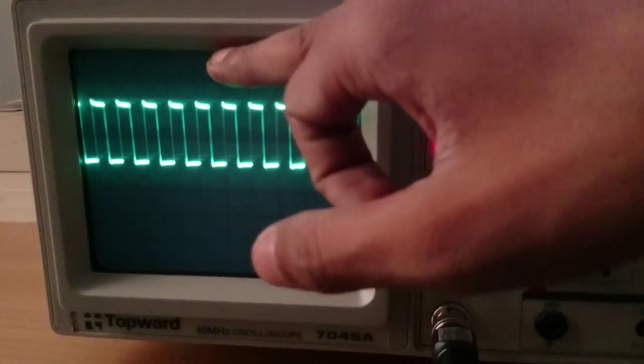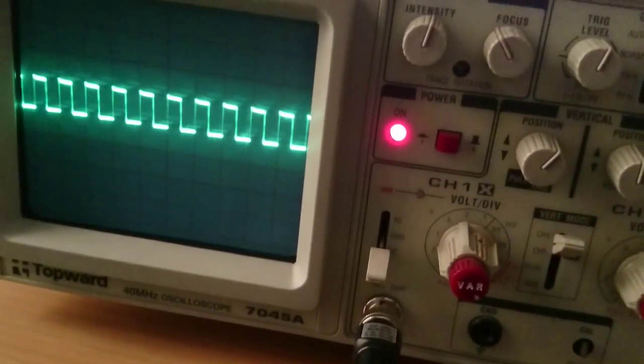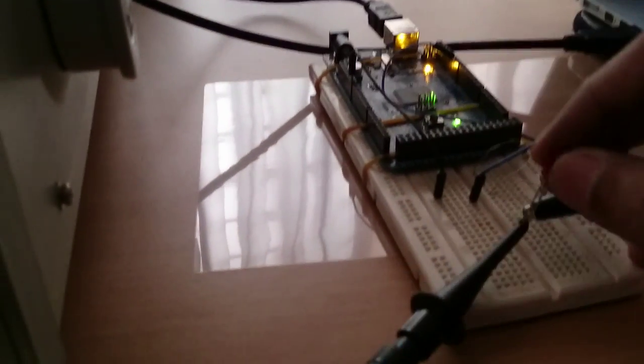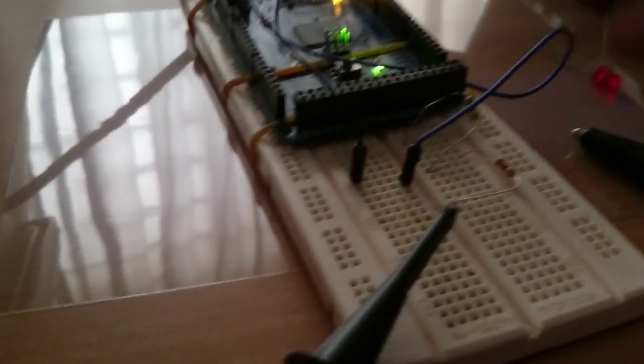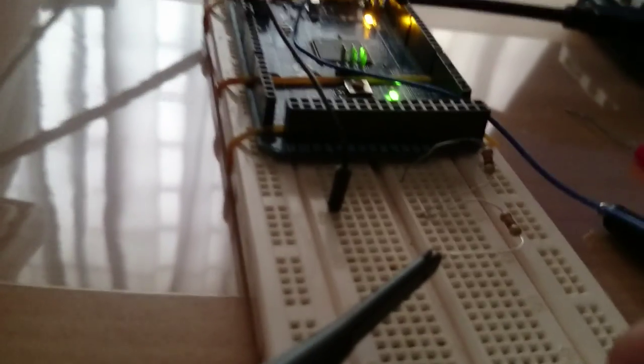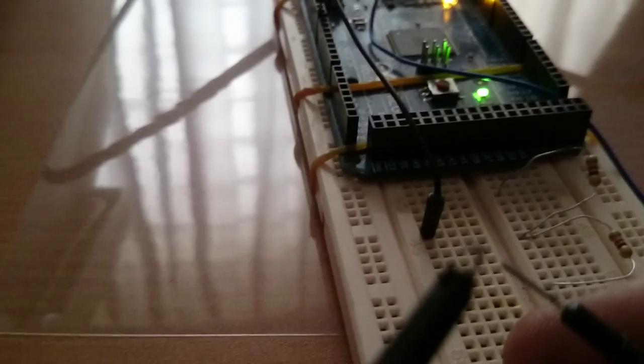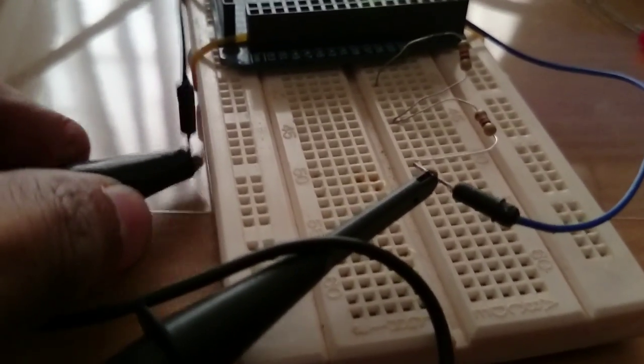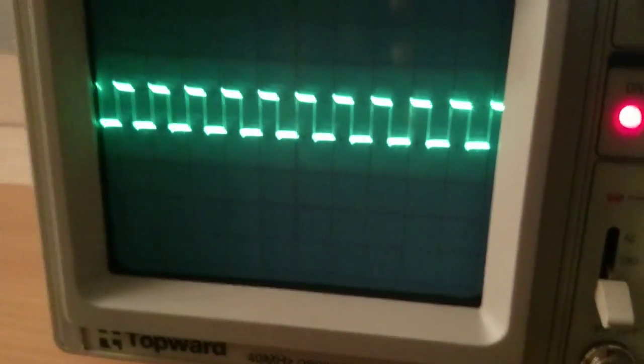So you need some coupling so that there's a spike and then coming down. Probably if I just remove this. My oscilloscope is really very old. You see now voltage is at 5 volt per division setup, and it's coming this way. Okay, let's first remove this stupid LED from here and connect it. Ground connections also in here. Now that's the spikes, because it's pushing a lot of current and then it's working in this way.